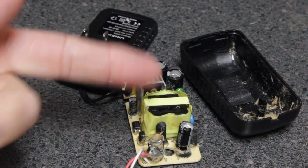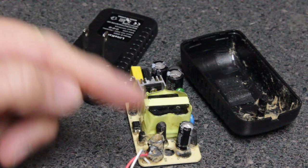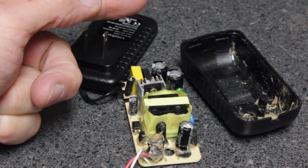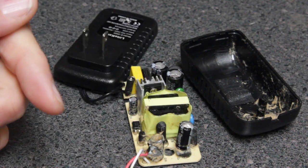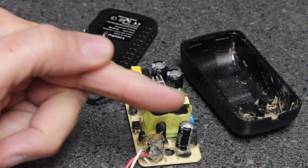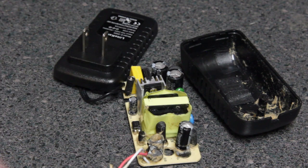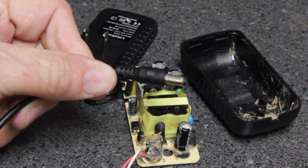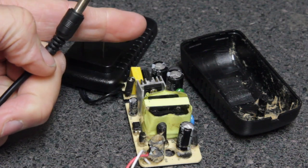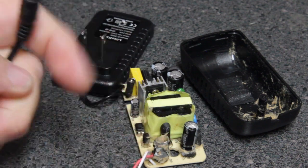The reason I'm showing this is because a lot of these AC to DC adapters blow up this way — they're made very cheaply. In this particular case there were no diodes. Think of a diode as a one-way check valve, just like on a faucet: a one-way check valve will allow water to flow one way but not the other. A diode performs the same operation — it will allow current to flow in one direction but not the other.